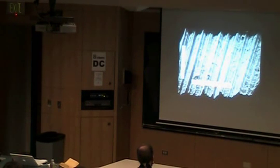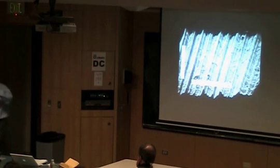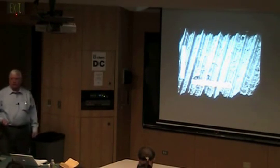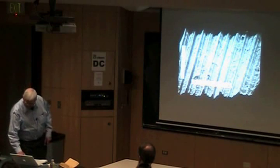We took this with an interesting imaging technique called photon tunneling microscopy. That's got a vertical relief of only a micron. I mean, a wavelength is about 0.6 of a micron, so this is sub-wavelength. And that's 1,000th of an inch there. That's greatly contracted compared to the vertical height. So this is what that process leaves behind. If you measured it, typically we got about 2 millionths RMS error for the area. And if you shine it up a little bit, make it look pretty, it's down to about 1 millionth. So that was very good 3-dimensional control, and that's what we were doing with it. People have built machines like that since, for what they call conformal optics and other kinds of freeforms. But we used that for some of your stuff and things.